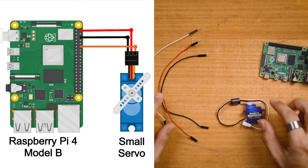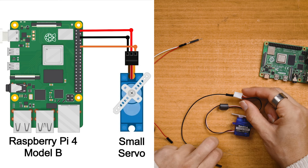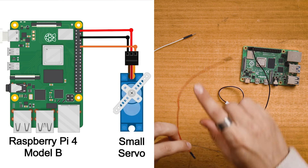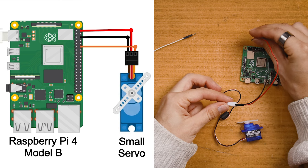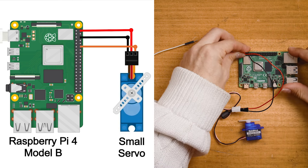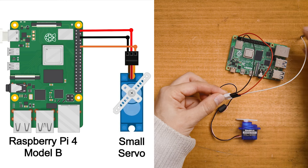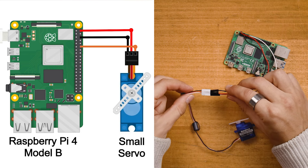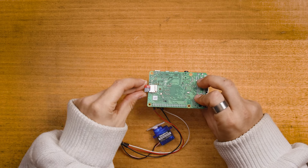Connect a ground pin of the Raspberry Pi to the ground wire on the small servo — black wire to the dark brown/black wire, most commonly seen on small servos. Then connect the 5-volt power, usually a red wire, to the 5-volt pin on the Raspberry Pi. For this example, I'll be using GPIO 18, which is pin number 12, as the data pin, telling the small servo the direction and angle to turn to. The data wire on a servo is usually an orange or white colored wire. You're also going to insert the micro SD card into the Raspberry Pi, and with that everything is all connected up.